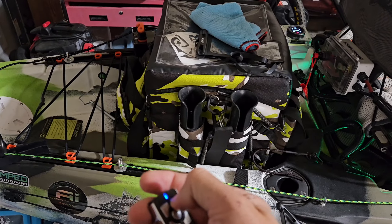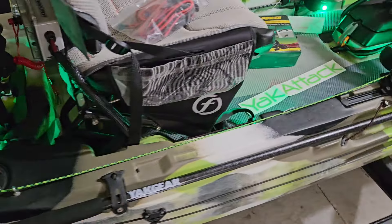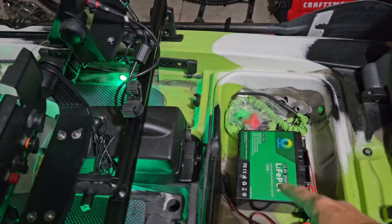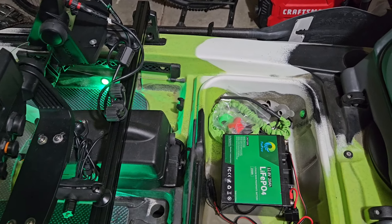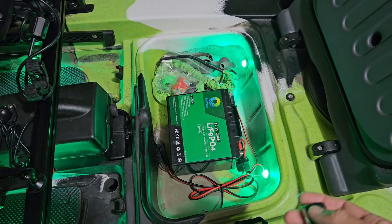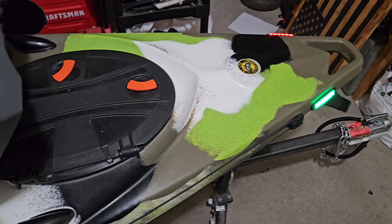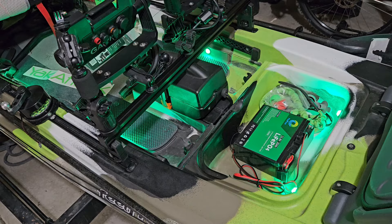On the controller I have a B button, which I use for a battery box — this is my battery box for my two fish finders, with 230 amps going there. I have a 20-amp fuse in right now but it's currently only a 130-amp battery; once I get the live scope on here I'll have 230 amps. That battery comes right on. Number one is my navigation lights — I'm actually going to get some brighter ones. Number two is my rear navigation light.